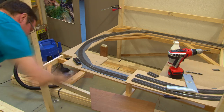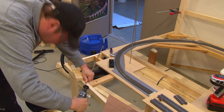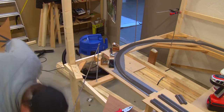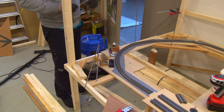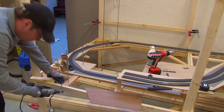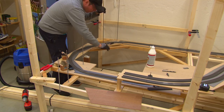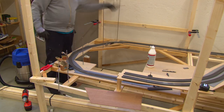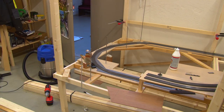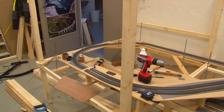The next step was to mount the threaded bars. I used different tricks depending on the underlying structure — either drilling a hole through the complete beam and using two nuts to fix it in place, or using an internally threaded nut so I can screw it tight. After doing the first one, I shortened the bars to the correct length — in this case 30 centimeters, since the top of the helix will be at 30 centimeters high. I used a Dremel for this. The points to place the bars are either on the corner of the hexagon or the middle of the inner edge, which gives maximum stability and keeps the tracks farthest from the thread to avoid collisions.